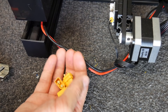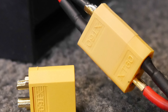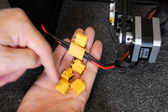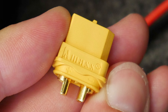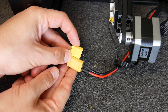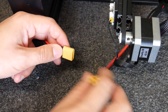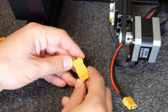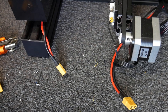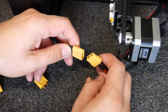What I actually have here are originals, bought from Hobby King, and the colors are actually different. These are a lot more washed out, this one is a lot more saturated — a stronger yellow. These have mounting points and little areas for seals at the end. This is going to the power supply and this is going to the 3D printer. So let's just unplug this. That's way too easy to do — these connectors should be a lot more durable in terms of plugging together. The original ones make a much more metallic, stronger connection, whereas this one is very, very poor, not nearly as durable.